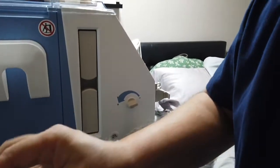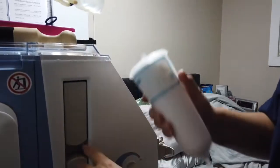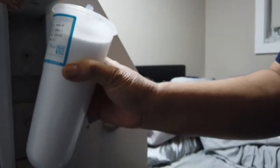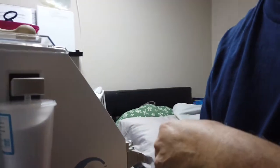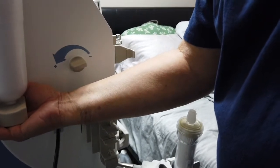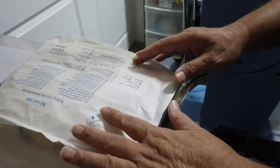The sodium bicarbonate requires a little more care. Open up the latches on the sodium bicarbonate line, line up the bottom, pull the top out a little bit, line up the top — when both holes are lined up, hold the bottom and push down from the top so it clicks together.